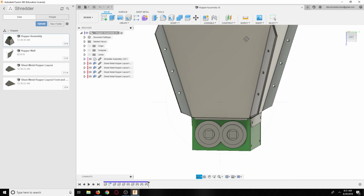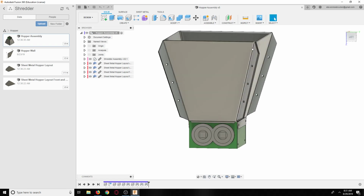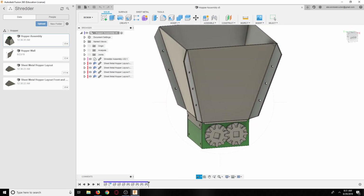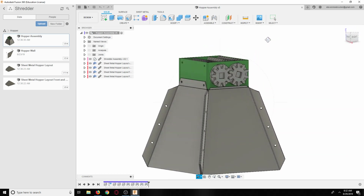So that's one thing. I'm going to have to look online to find some sheet metal guys. These are pretty simple bends, so I'm pretty sure I could just have it lasered, and when I have it lasered, I could have them etch this line of where to put my finger brake. So I put my finger brake there and bend it up, and have them punch the holes with the laser. Or on my water jet, when I get my water jet, it's obviously a little harder to do the etch, because you have water shooting everywhere. But we can figure it out.